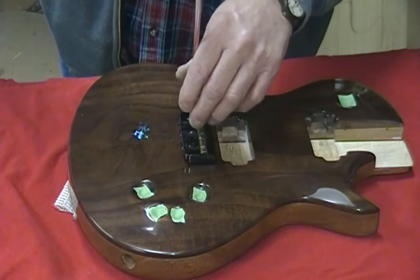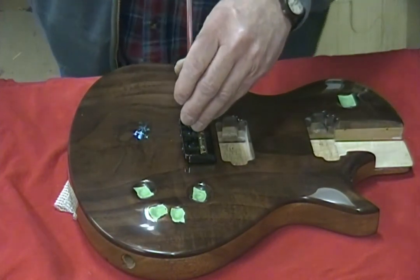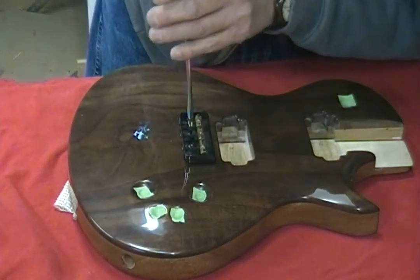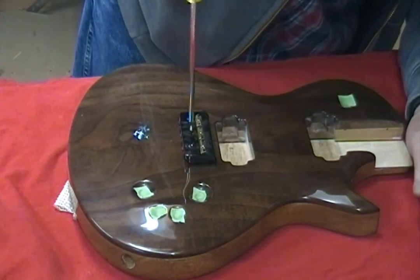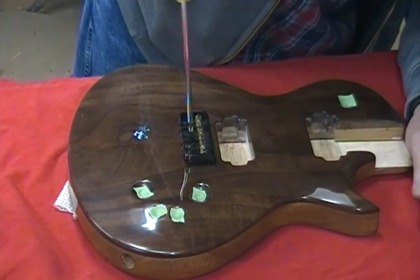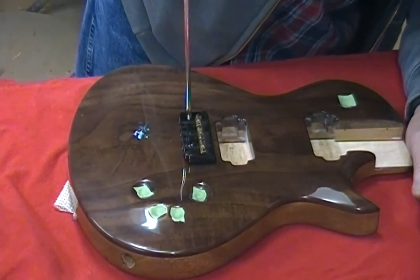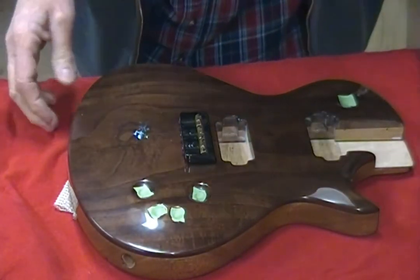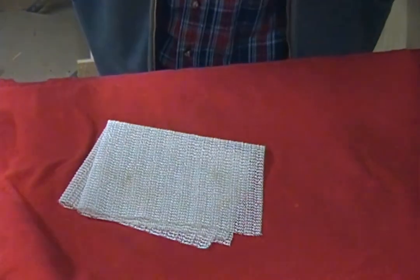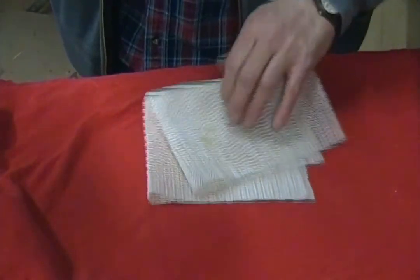Some of your other woods, mahogany, alder, poplar, pine, just softer woods, wouldn't be a real issue, but it would be in this board if you were to not use the right size pilot. And then also some wax on the screw just makes it easier to put in. And I'm just trying to blow off the excess wax that comes off as you thread the screw in.